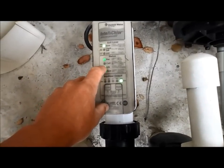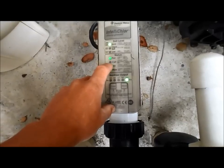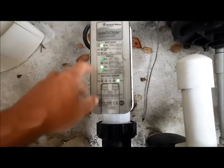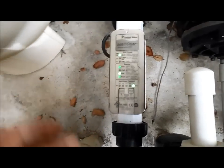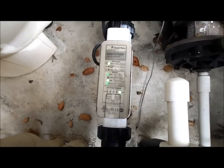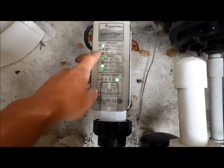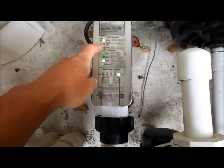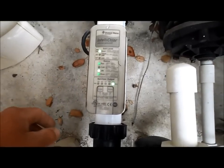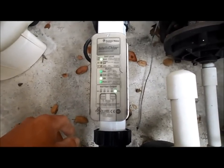If the cell light is flashing green, this unit will not be producing salt. So it's very important to clean it when it's flashing, otherwise it will not be producing anything. These lights are good indicators, but I generally clean the salt cell right before I add salt in the summertime. Right now it's going to be April next month and that's when I usually clean all the cells. Then I add the salt after if it needs it, and I'll show you how to check the salt level also.